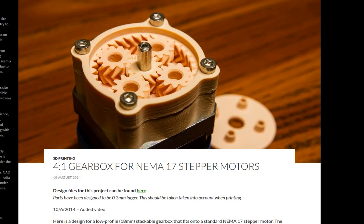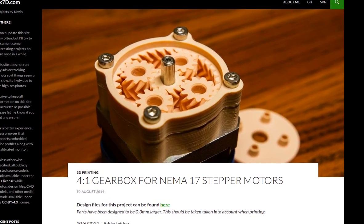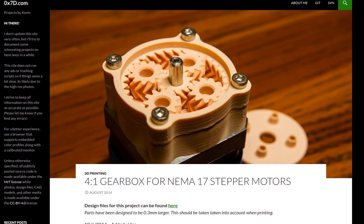I have some problems combining parts in FreeCAD. Make something very simple, like cylinder minus sphere. Sometimes you will see some strange artifacts when you create, for example, a Boolean, and you cannot see through it because there are some bugs in the representation of FreeCAD. Well, that's the Boolean workflow. The workflow that works really well is pads and pockets. That typically works really well.